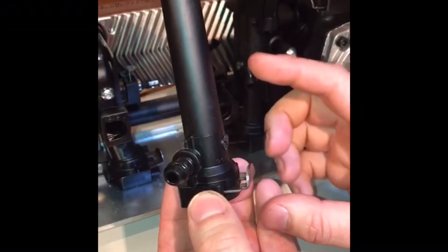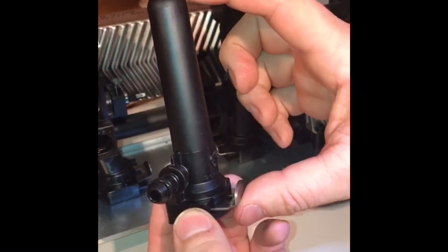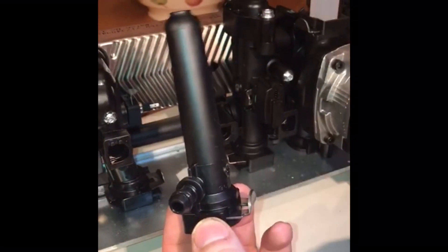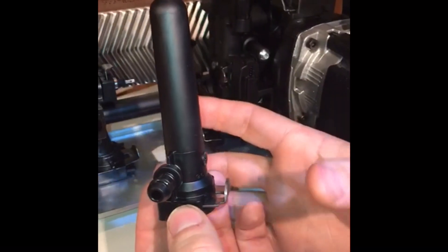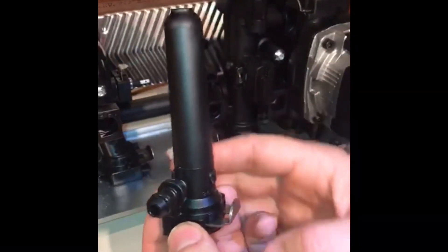This shock arrestor is basically a pocket of air. There are no springs inside — it's just a pocket of air. This protects the system and allows the water to expand inside without splitting the composites.